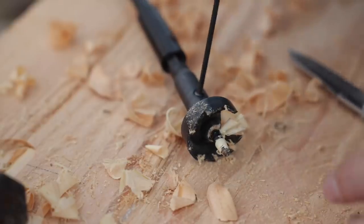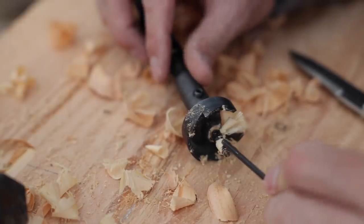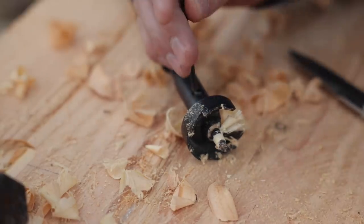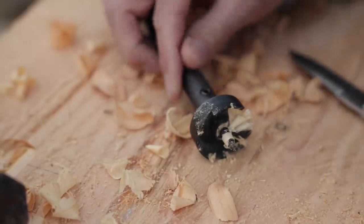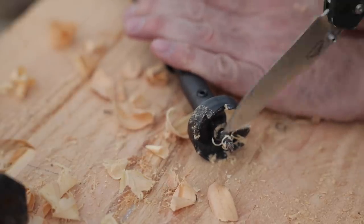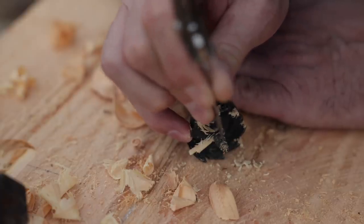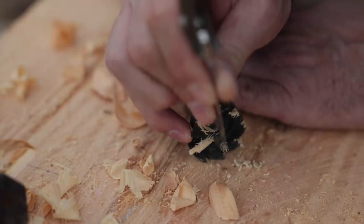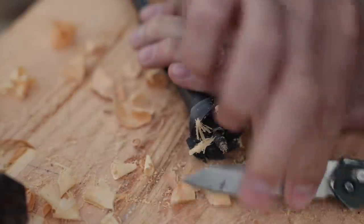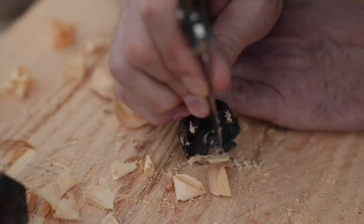This is a self-feeding bit — it's got a screw in the bottom, and this is what pulls the bit down into the wood. You can't push hard enough with a bit this big to do it yourself. I noticed it slipped out a little bit. These are replaceable — that's why you'll see the grub screw on there. You can see it's completely covered with sap and wood, so if your drill bit won't pull, clean that off. And please spare me the comments about the knife. This is a tool to make your life easier and solve problems — that's why you carry it, and that's why you should know how to sharpen it.